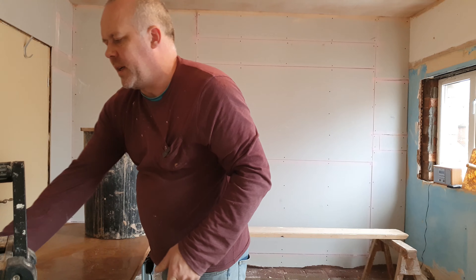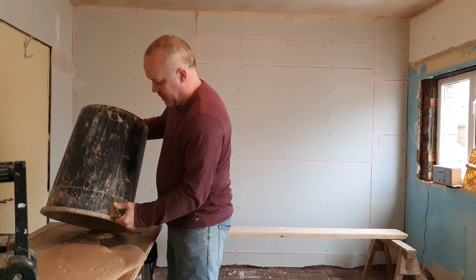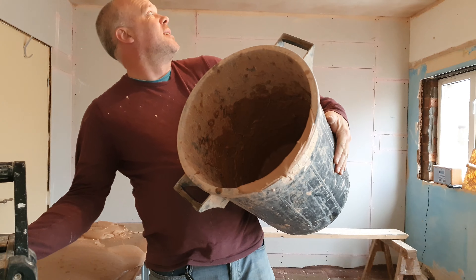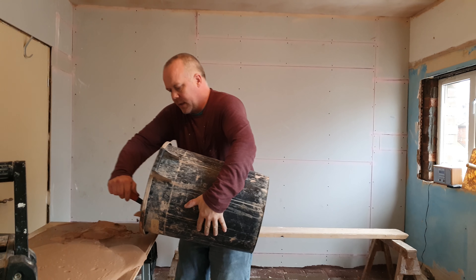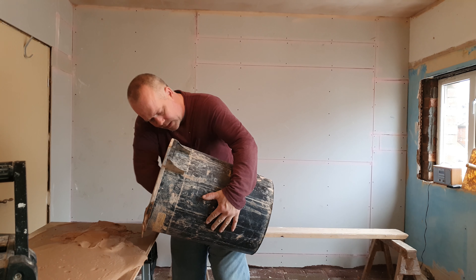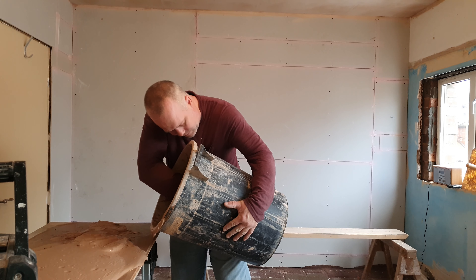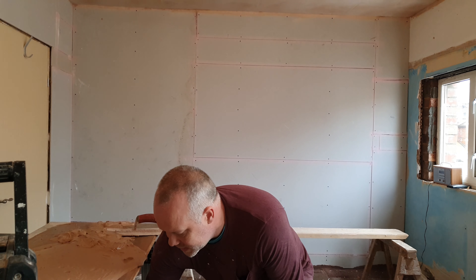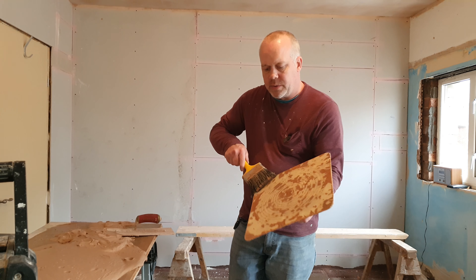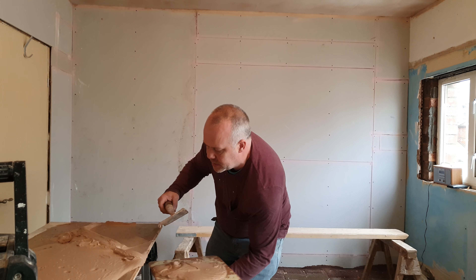Because it's plasterboard I don't need to PVA or SBR bond it — you can go straight on top of plasterboard, it's wonderful to plaster on. You don't get the slide you get with PVA. The most important thing with plastering is controlling the suction on the walls; if you don't control the suction you're going to really struggle. With artex ceilings or a normal wall you're going on top of with plasterboard, it's much easier where you don't have to deal with that.